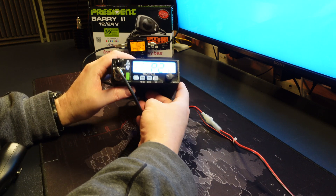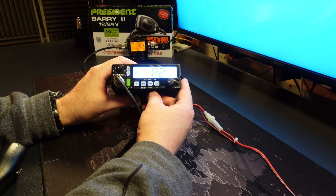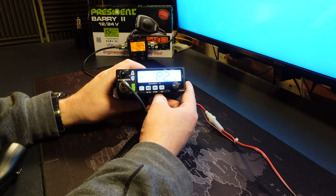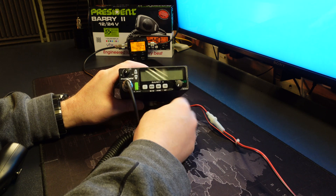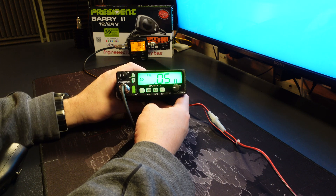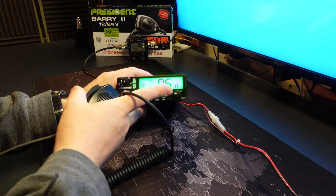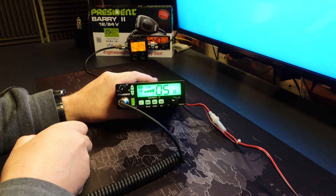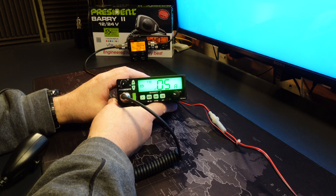We are currently running at 7.21 watts after adjustment. To exit this menu, remember that this radio is currently in the modded state, and the modded state does increase the power output slightly — so you may get different results if you enter this menu without the mod applied. The TS displayed when you power on tells you the radio is in modded state. Powering back up, we're now at 7.15 watts on FM channel 5 after making that adjustment to the P2 setting.